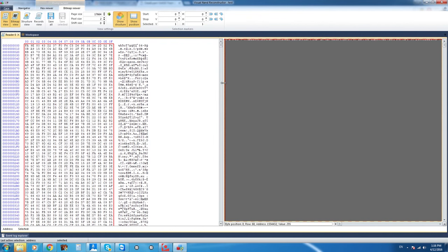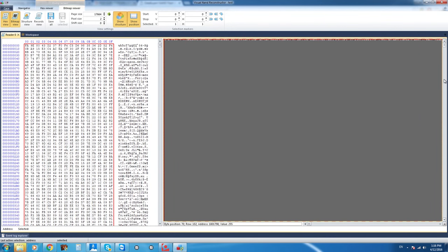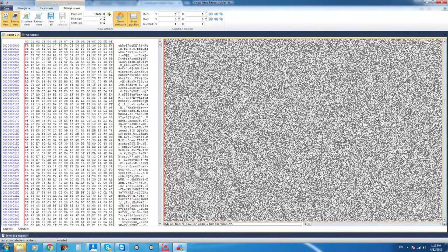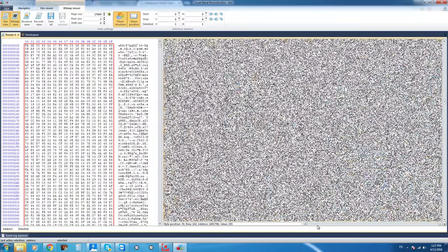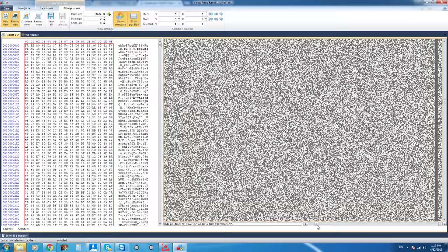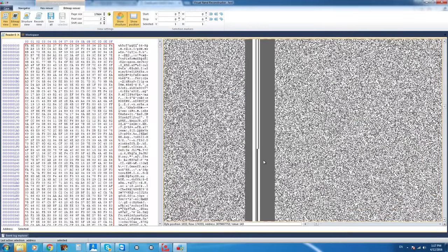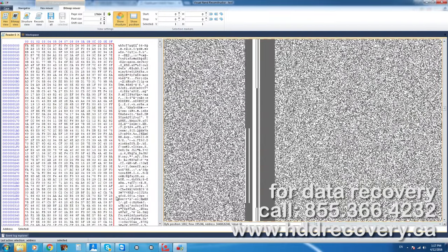If we go into bitmap view, we're going to scroll through and locate some portion with data in it where we can see the noise, because there we're going to have areas that are spare area, which are vertical lines. Vertical lines will show us how clean the reading comes out from the reader. As you can see, those vertical lines don't really have any inconsistencies, so it's a pretty clean read. We can just read it as is. Once the extraction of raw data is completed, we can begin determining what chain of data conversion elements had been used in order to reconstruct that data and put it into a structure.